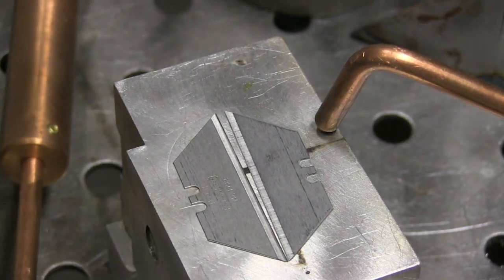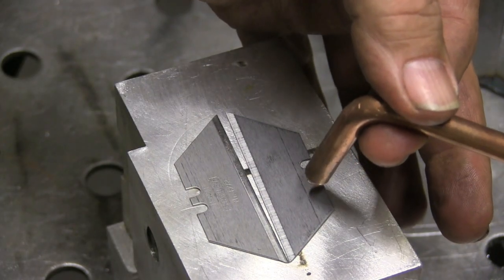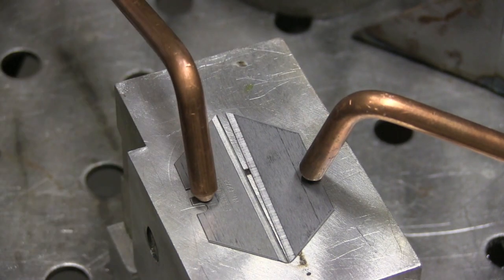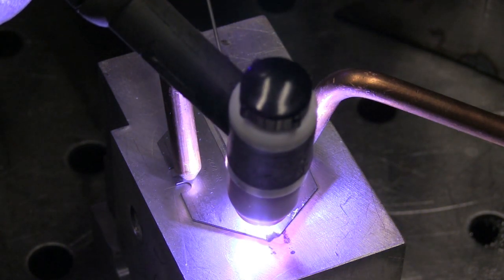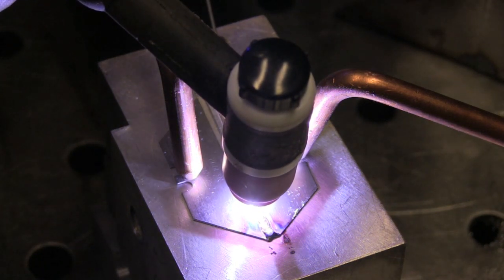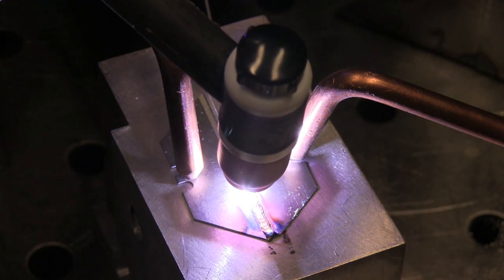This will be very obvious to some people, maybe not so much to others, but this is a cool little demonstration on the effects of shrinkage stresses on a joint. I've got a couple of box cutter blades here, they're about 25 thousandths thick. Gapping it even an eighth of an inch on one end, no gap on the other, no tacks — just welding it out will demonstrate how it wants to close up because of the shrinkage stresses of metal. It's a fundamental principle: weld metal — and any metal — once it heats up and cools off, things shrink.